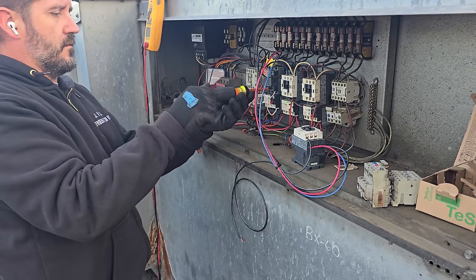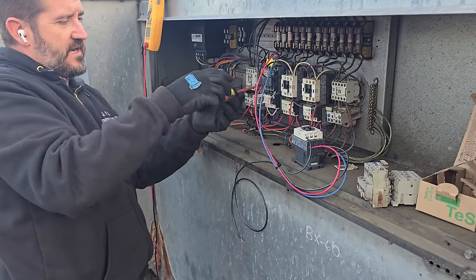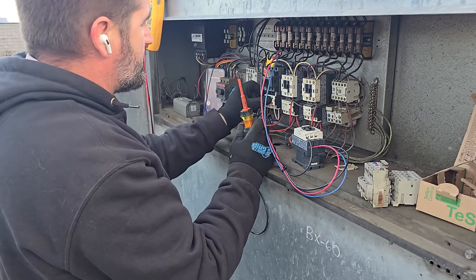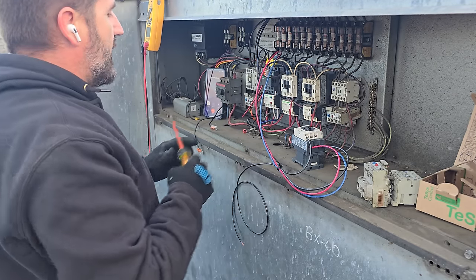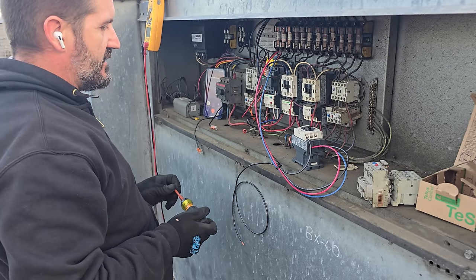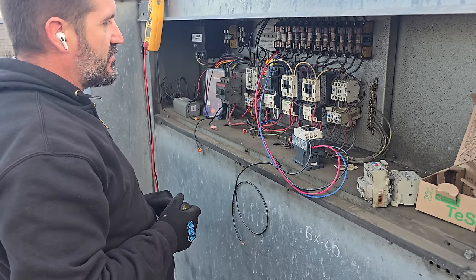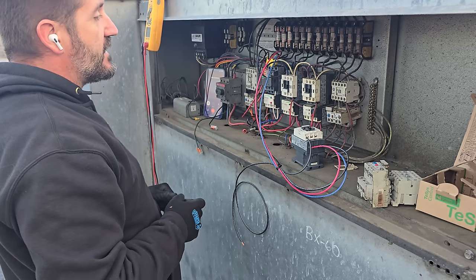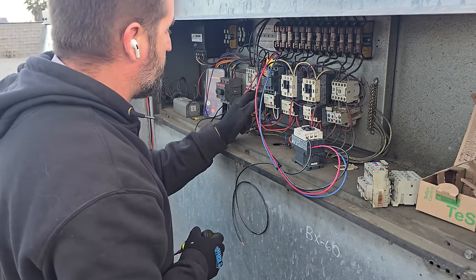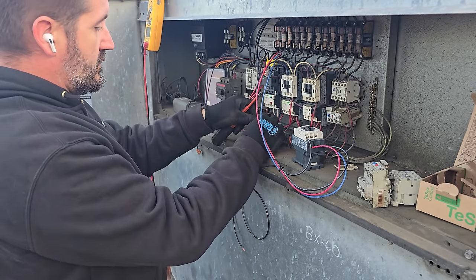Okay, so I already kind of see the, I talked to the kitchen manager yesterday. They called saying that the walk-in freezer was at 20 degrees and the fans weren't running. Then Joe called them and they said the fans were running and it seemed like it was coming down to temp. I got there this morning. The ice cream is firm, but the thermometer says 20 degrees. I think they have a bad thermometer, but it also looks like it might be frosty up there. So hop up in there before they get that delivery completely blocking off the walk-in and see if it's iced up or anything and go through that, okay? All right, bye.